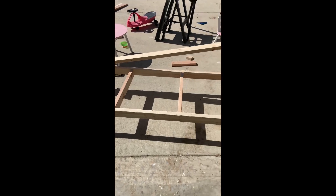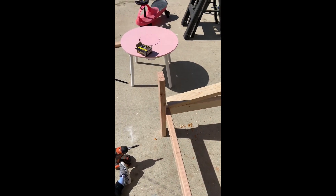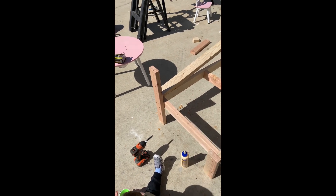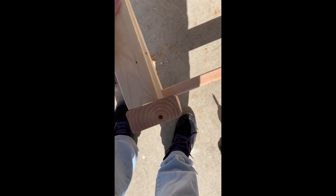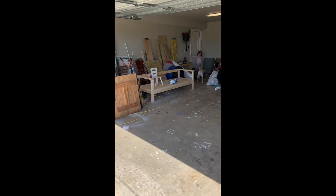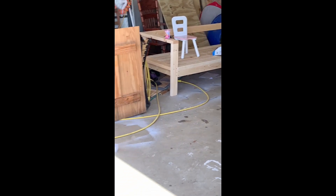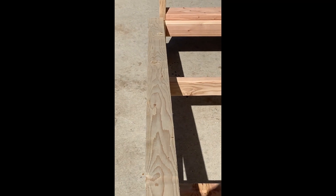Once you put the arm on, measure from the bottom of the frame to the floor on either side to make sure it's the same, then make sure it'll be even on the other side too. Mine are about nine inches from the bottom of the board to the ground. The back board is one of your 25 and a half inch boards — measure it to the length you need. Next we put the back piece on, which connects to the other side. I used pocket holes on the backrest of the last bench and I'm going to do the same on this one.